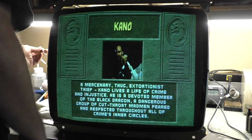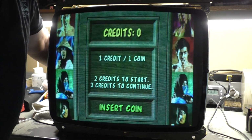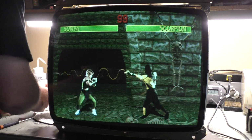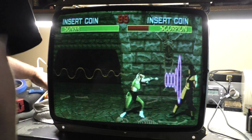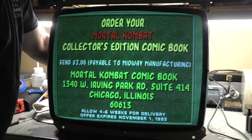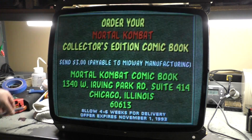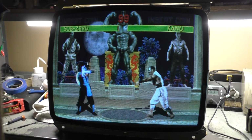We'll grab the tool and adjust the coil. And go down. Yep, there we go. Let's wait for another screen here. And turn in the pot, turn in the pot, turn in the pot. Now we need to adjust our position slightly more. There we go. And let's turn it a bit more. There we go. We're a bit too green, but like I say, it's not a big deal because it's not staying on this tube. Well, if we turn the green down a bit and contrast up slightly, look at that. That is looking pretty good.